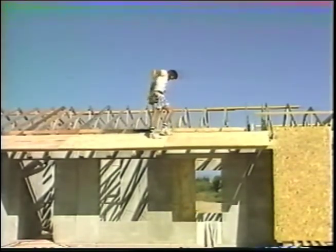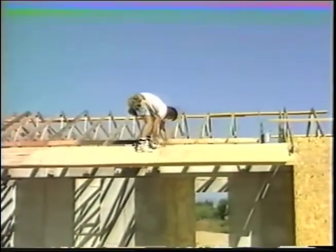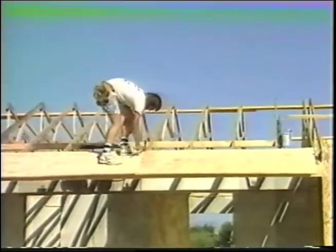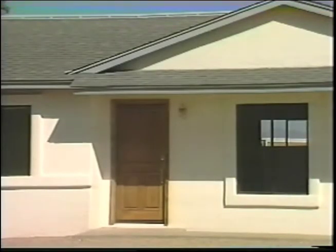Fiber panels may be used for roofs in smaller homes with slight pitched roofs. The trusses in the bedrooms of the sample house form a typical 8-foot ceiling, while the trusses in the living room, dining room, and kitchen area form a vaulted ceiling which is 2 feet higher at the ridge, giving the house an open and airy feeling. The roof trusses form a 2-foot overhang on all elevations with an extra extension over the front door and walkway.